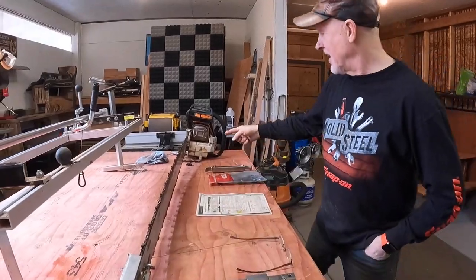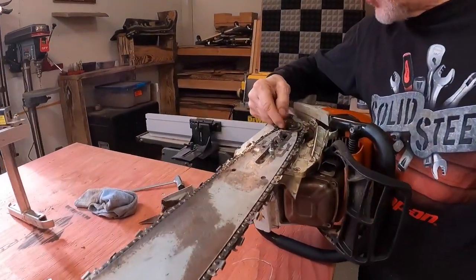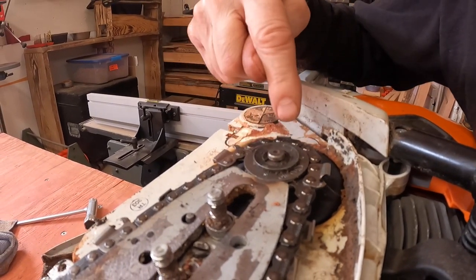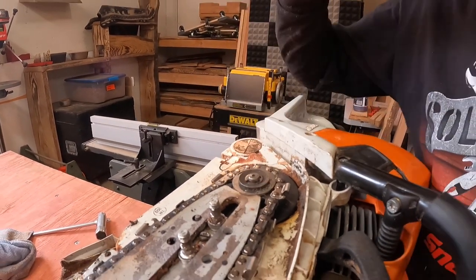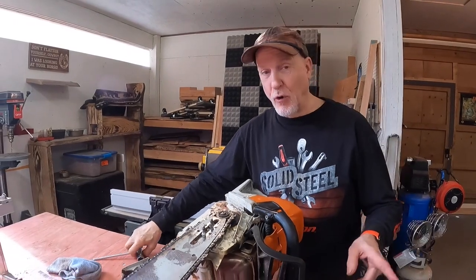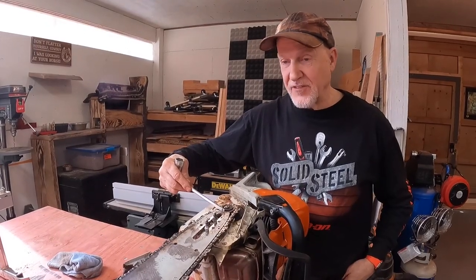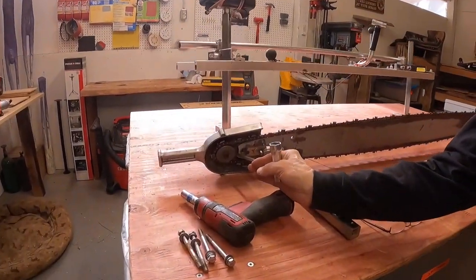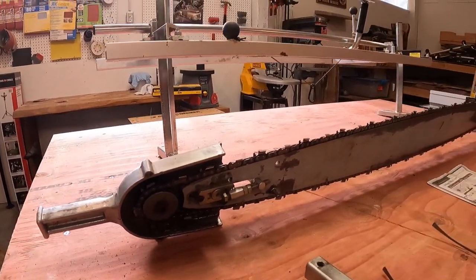And we'll back this off and get some space up here, because if I don't get space up here, I'm going to cook this and get enough heat into it that if the bar isn't useless, certainly that cog and the clutch are going to heat up unbelievably. So we're going to take a little break now. I'm going to make the necessary adjustments. Again, I'm not going to open it up after I make the adjustments, but I will make sure that there's at least 3/16 of an inch in here. I've got lots of room down at the far end. I can tighten this up to where I've got a good 1/8 of an inch or 3/16 down here. And then I'm going to set it up in Alaska chainsaw mill format.